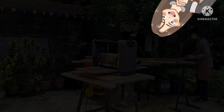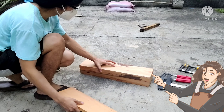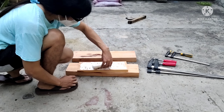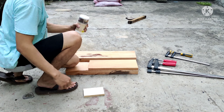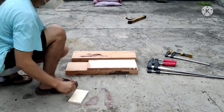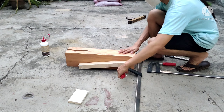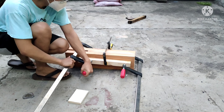This is the glue-up of the leg. I'm going to take two two-by-six pieces and sandwich a one-by-six piece. The one-by-six gap is perfect because they are a cut-off from the long one-by-six planks we are going to use for the sides, so when we fit everything in it will fit nice and snug. I'm going to glue all four pieces and let it sit overnight, making sure they are close to flush.